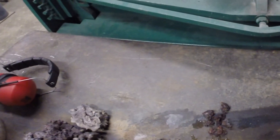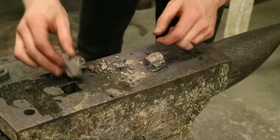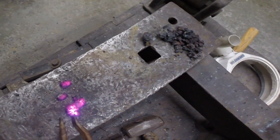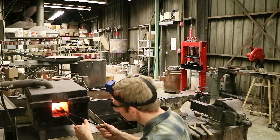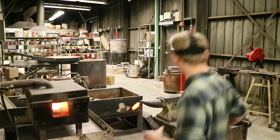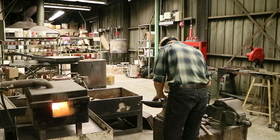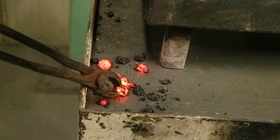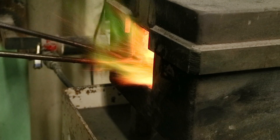I have come to an opinion about this particular bloom. I think that it's basically just slag, that the iron particles are not doing what they should be doing. It's interesting that it rusts when I put it in water, which is an indicator. What I've seen some smiths do is basically run a second furnace using the bloom from a previous furnace, the slag from a previous furnace, as the ore, or as a contributing part of the ore. You can see how it's been breaking apart every time I hit it with a hammer, and that's even when it's red hot. What that suggests to me is that basically what we have here is slag.